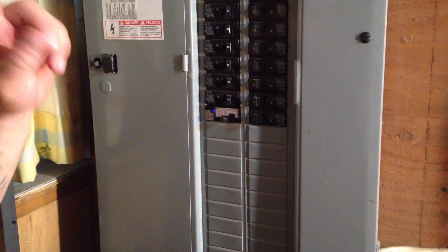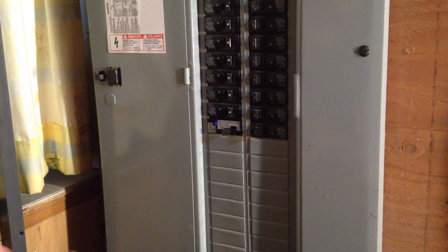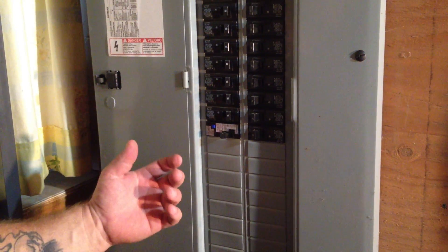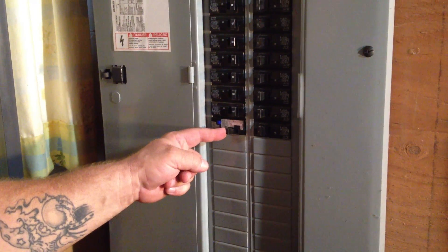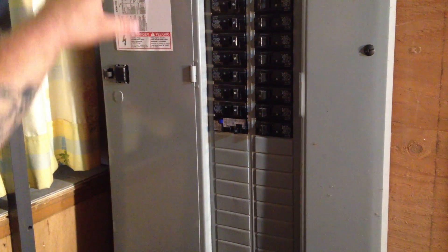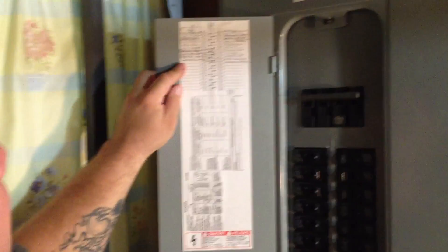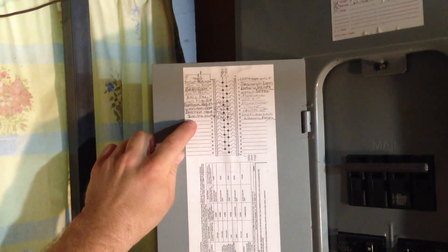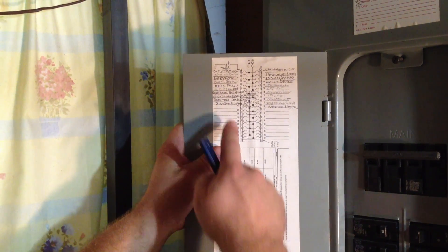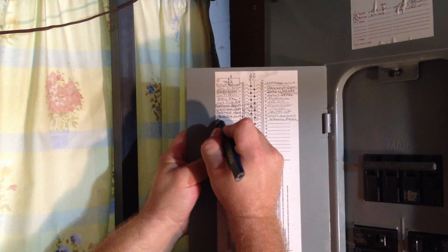You have an on/off — right now remember it's in the off position. Before you turn it on, you have to make sure that everything is connected on the end that you're working. So in our bathroom, everything is connected because we already wired everything up. So we go ahead and turn it on. As you can see, it's on and it never tripped, which means everything is wired properly. Now we have to locate the number of the breaker — this is breaker number 21. We go up to the legend up here on top, locate number 21, and we have to label it. What we're labeling this is: first floor GFI outlet.